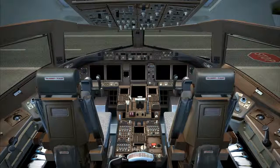This comes under the category of supplementary procedures, differentiated from normal procedures as they are accomplished on an as-required basis rather than being performed routinely on each flight. This procedure, combined with the steps we went through a few minutes ago, is accomplished to permit safe application of electrical power to the aircraft. Select the battery switch on.